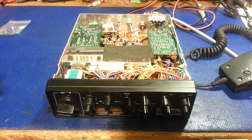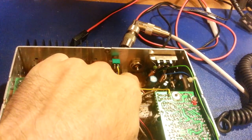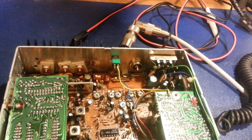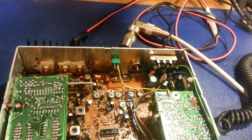Stuff can break, and that's exactly what happened in this radio. What broke is the wire that goes to the antenna connector. We're not going to have any RF output power if that's not attached to the coax connector on the back of the radio. It was receiving somewhat because it was making an iffy connection — just a few electrons' widths away from the connector, so it was able to pick up a little bit of signal.